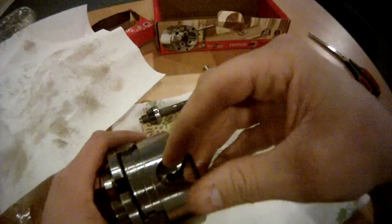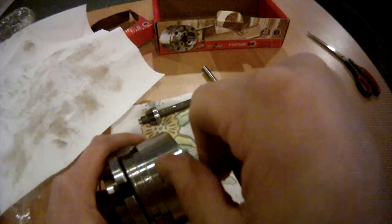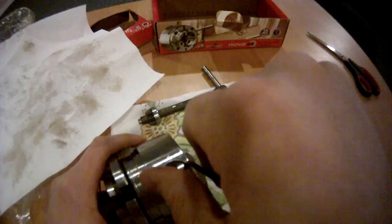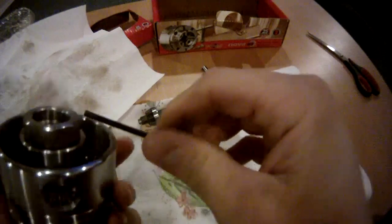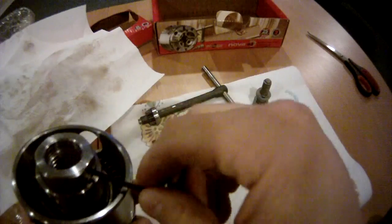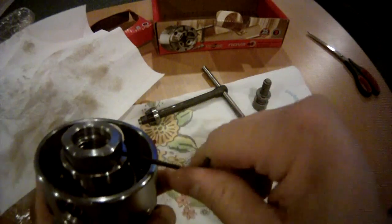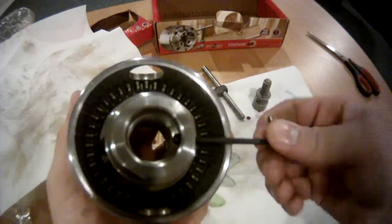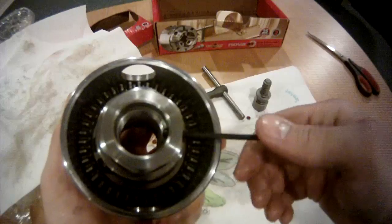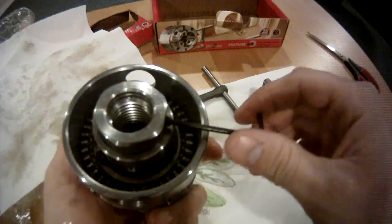The screws for the chuck jaws are described as being an M6x6 screw. The set screw here is a little bit smaller, and there's another set screw on the side. And the Allen wrenches that are provided are a 3mm and a 4mm Allen wrench size. And so if you look in here, there's this Allen wrench here. We can use a set screw here to be able to secure this onto our lathe so it doesn't spin off.